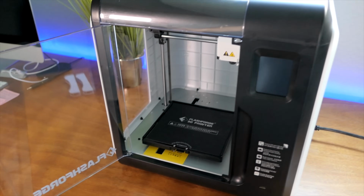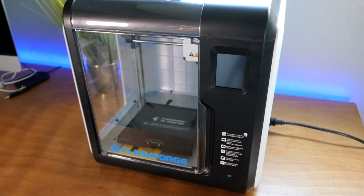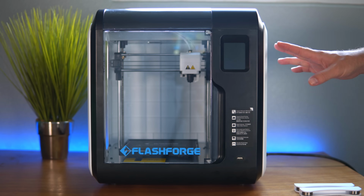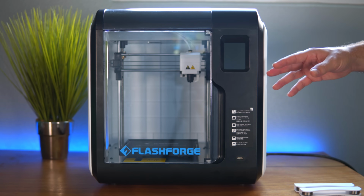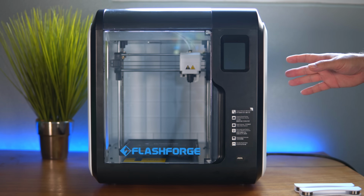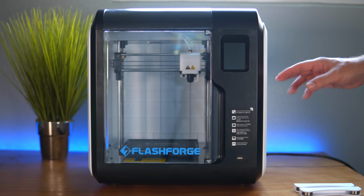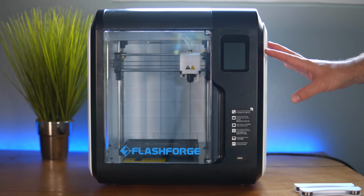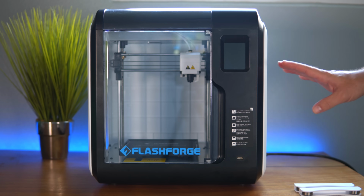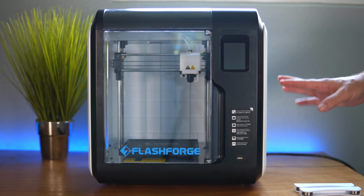And actually, I've been really excited about trying something I've never done before, which is printing ABS. Because I've never printed ABS, I have no idea what it's like or how it reacts when printing. So the FlashForge Adventurer is going to be the first printer here that I print with ABS, and we'll see how it goes. Because it has an enclosure, I think that's going to help us quite a bit, because we're not going to have any random airflow, and we'll be able to retain a little more heat than usual. I'm pretty excited about that, and let me show you the filament that I got.